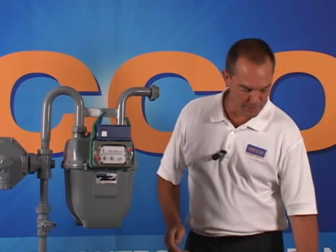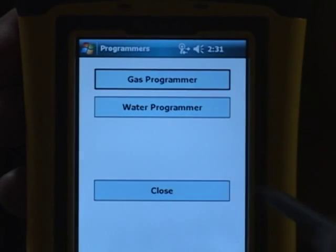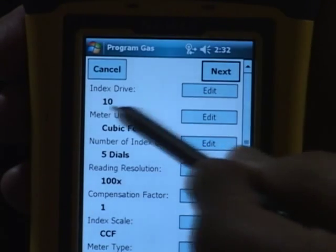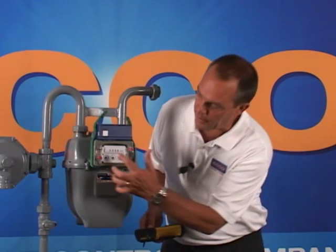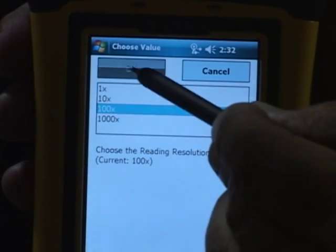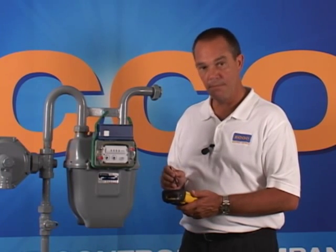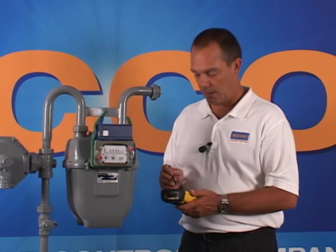At this point, get your Nomad into the FlexWare programming. From the FlexWare main menu, select Programming, then select Gas Programmer. Select Index Drive — this meter is a 2-foot meter index drive. Number of dials: 4, as this meter has 4 dials. The reading resolution, select 100X. Compensation factor is the default of 1. Index scale, select CCF. Meter type, select Direct Mount. Select Next.